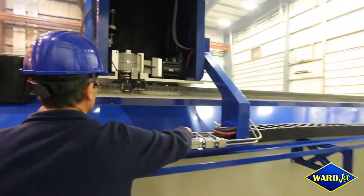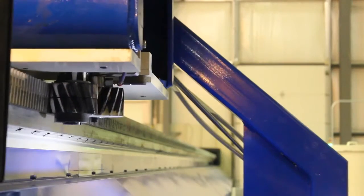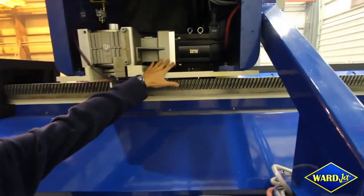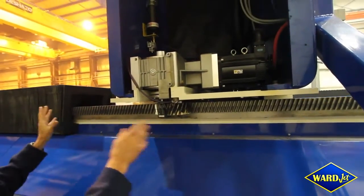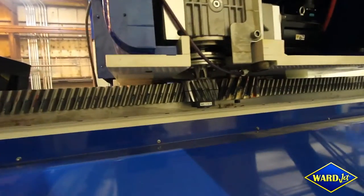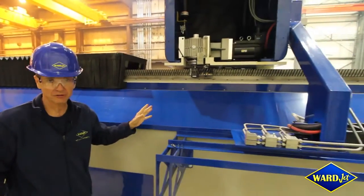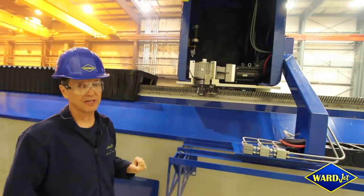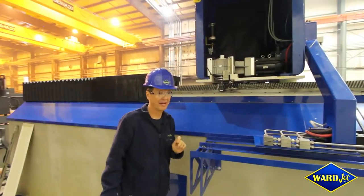Here you get a closer look at the helical rack, the split pinion, and automatic lubrication. Here's your motor up here — you can see the beam coming in and that's what's driving the mechanism. We then have linear scales for positional accuracy, so these are extremely accurate machines. Even though it is a substantial length, with the split pinion we have zero backlash.